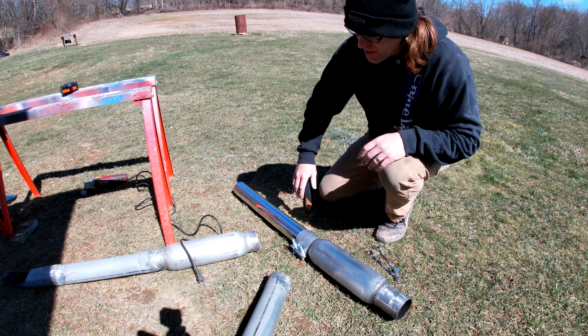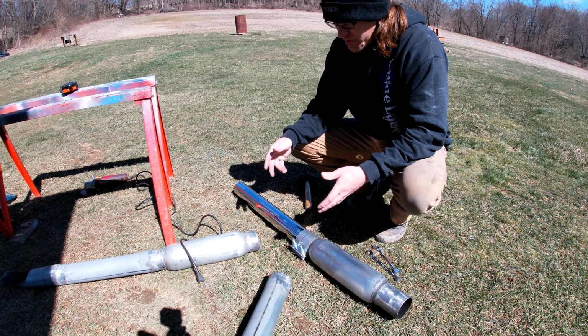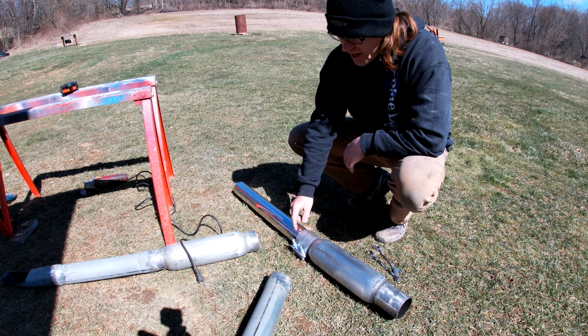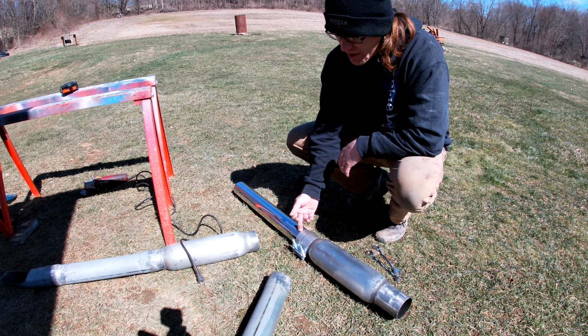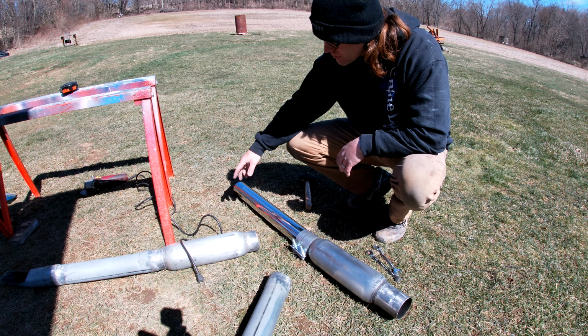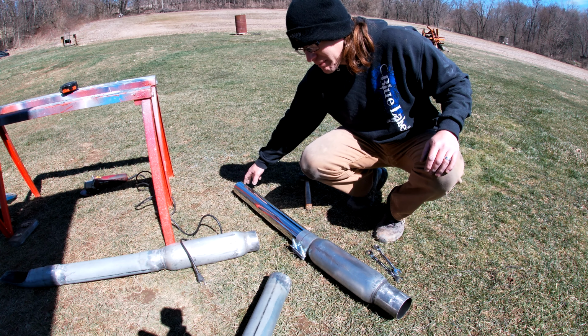I just have this here, so simply it's gonna stay on. I'm going to get the stainless part as straight as I possibly can and as deep as I can into the crevice, or the radius here. If I can get that straight as I possibly can, as deep as I possibly can, and still keep it straight, I'm going to do a nice weld here and a nice weld on the other side as well. That's going to be on both sides. And then once I get that on there, the header itself, I don't really want to weld it, but I don't have much choice unless I get 2 more of them.